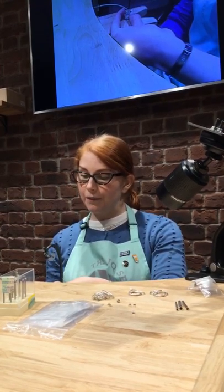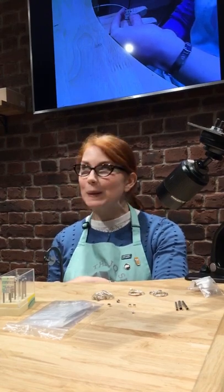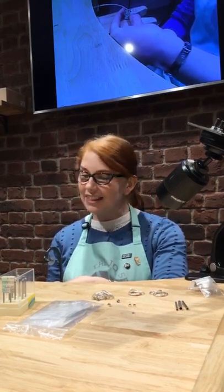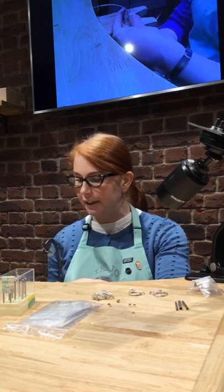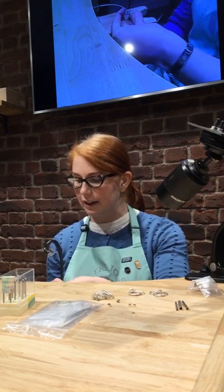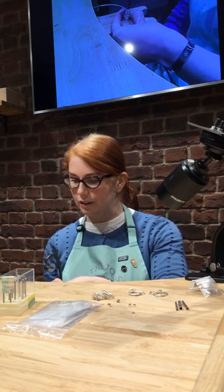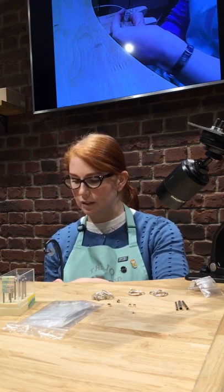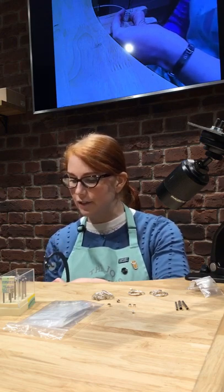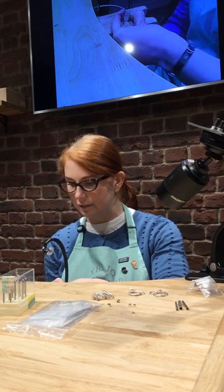Tips galore. That's why they're there. These bench pegs are your tools and you customize them to however you want. So, this one's not very well straightly cut, I have to say. But you use the side of the V as a guide to keep your saw blade nice and still until you've got enough of a groove where you can just start cutting completely.